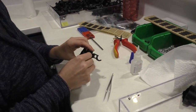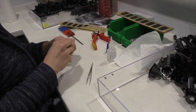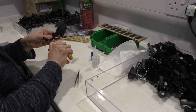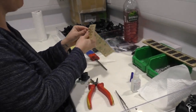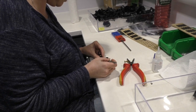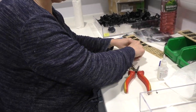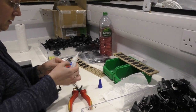On this arm, we've decided to have a fixed bias. I don't know if you'll agree with that or not. Well, first-time users get very confused. Yeah, and every cartridge that's going to probably go in this arm is going to be a similar tracking force, and anti-skating. It's a compromise anyway. Right, anti-skating is always a compromise. So skating we have it, but it's fixed. As we've lectured people, skating is dependent upon the vinyl formulation, the stylus profile, the tracking force, and the amount of modulation in the groove, and it's changing all the time. It changes continuously. Right. But no anti-skating means it's going to ride the inner groove the whole way, so you've got to apply some, and a little.